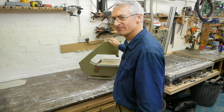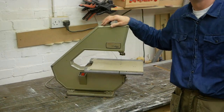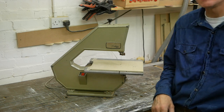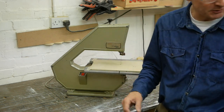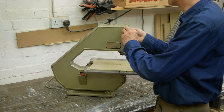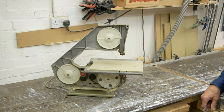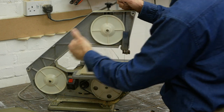I've got a bit of a confession to make. I've mentioned in passing in a couple of recent videos that I don't own a bandsaw — it's not strictly true. This is my bandsaw, a Burgess bandsaw, British-made from the 1970s, made in Leicester. Very 70s in design, almost no health or safety features. No micro switches on the side plate — you can take the side plate off with the saw running and have access to all the sharp, spinny parts.